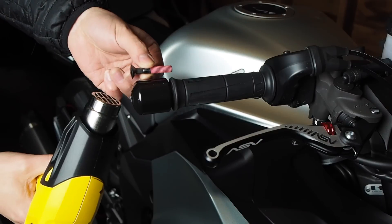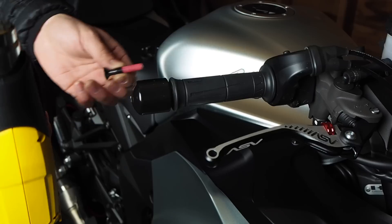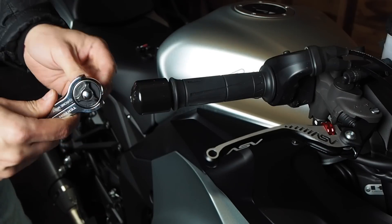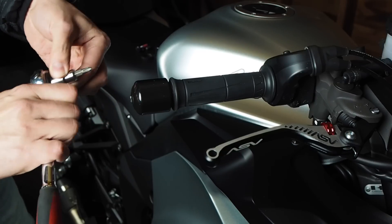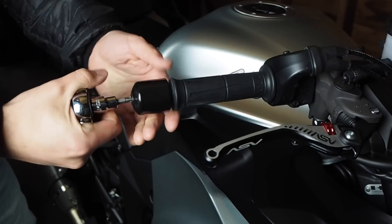And so that's how far in this is. Basically once the bar starts getting pretty hot, you know that you're getting heat into the Loctite. Then to actually remove it, I used a ratchet with a number three screwdriver bit. This gave me enough torque to actually get this thing loose, and it's already loose now — so it will come out easily.